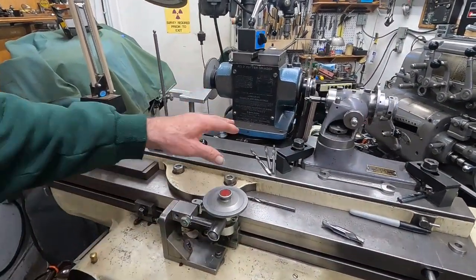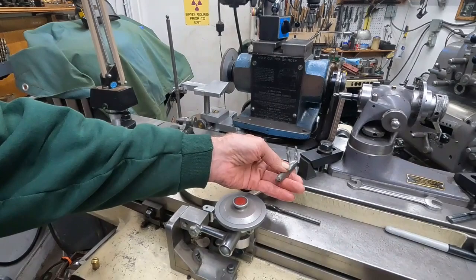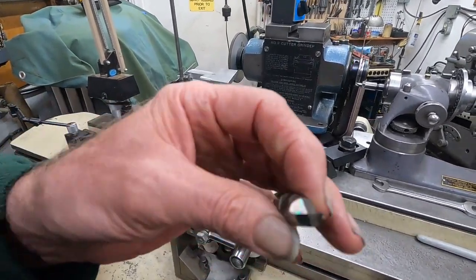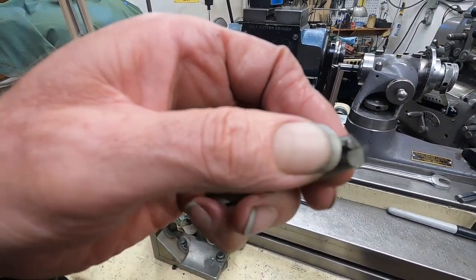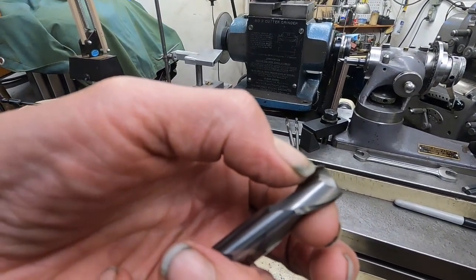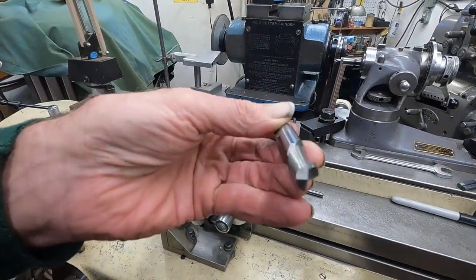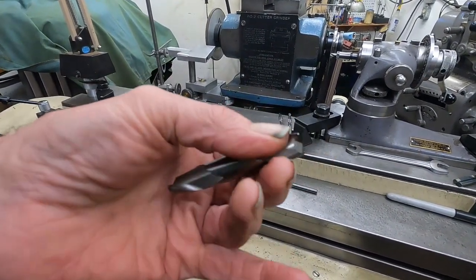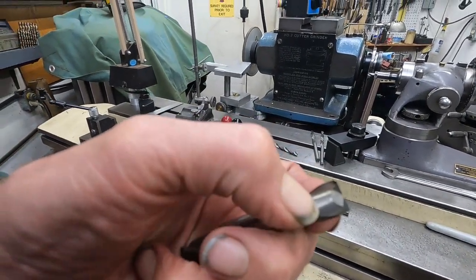Well, I'm going to complete this — cutting the tips off. I got an end mill from a viewer here who sent some tools. I'm going to cut the ends off it. You can see one lip there's toast, and you have to make a decision whether you're going to grind that back with your cup wheels and other wheels, or if you're just going to cut that end off. This one's not too bad, but it's still quite a distance to grind back. I'll be back when I get that running — I'm going to sharpen some of this stuff.